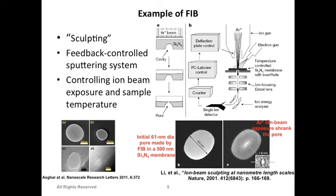When you start drilling, ions hit the surface and take some time to drill through the membrane. Argon ions are positively charged, so as you deposit charge on the surface, new argon ions will be deflected sideways, making the pore geometry non-uniform and potentially larger than expected. If you have an electron gun continuously showering electrons there, the argon ions after impact will be neutralized. Once neutral, further incoming argon ions won't be deflected, which is very important for uniform pore geometry.